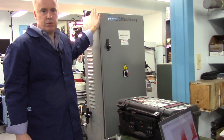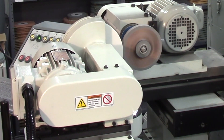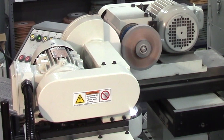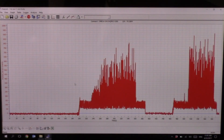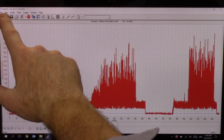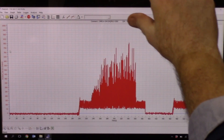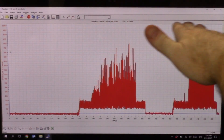We've had this hooked up to the Rush truing machine, and we're truing a diamond wheel with a silicon carbide wheel today. This is what we have from two different tests. Zooming in on the axis, we have power in watts — here the maximum scale is 1,000 watts, or 1 kilowatt, at the top, going down to zero.